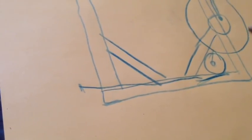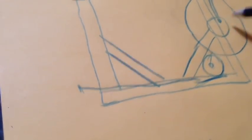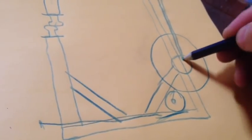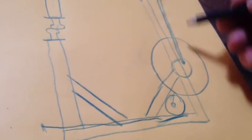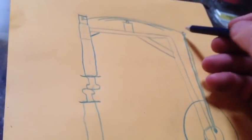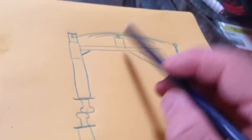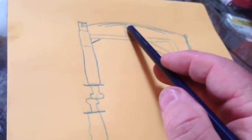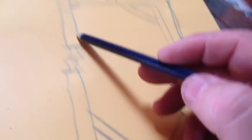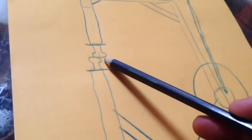So as the wheel turns, I'll have another plate here with an offset pivot, which, when that turns, is going to push that shaft up and down, which will in turn push that spring, that Hilux spring that I've got, which will pivot in the middle. And as that pushes up, it's going to push that down and it's going to smack my metal like a hammer.